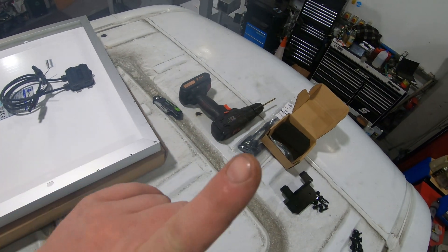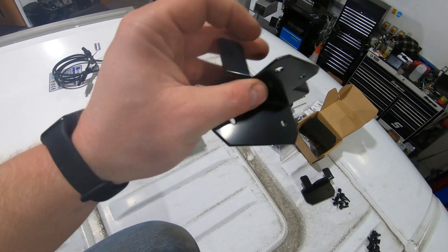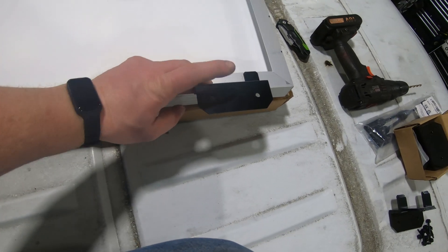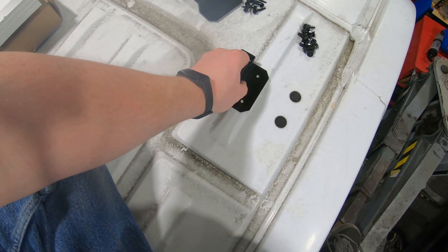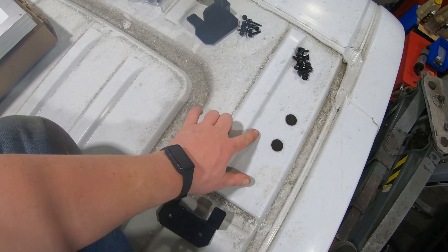Welcome to my roof! I've got everything up here now, apart from I forgot to pick up the tiger seal, which I'll go and grab in a moment. We'll need that when we stick these down. These brackets — I've turned the solar panel upside down — they're going to go this way around so the wider base goes into the roof. These are different to what I've used before; I normally use white plastic ABS moulded ones. These are actually designed for roofs with ridges, so you can mount them at various points.